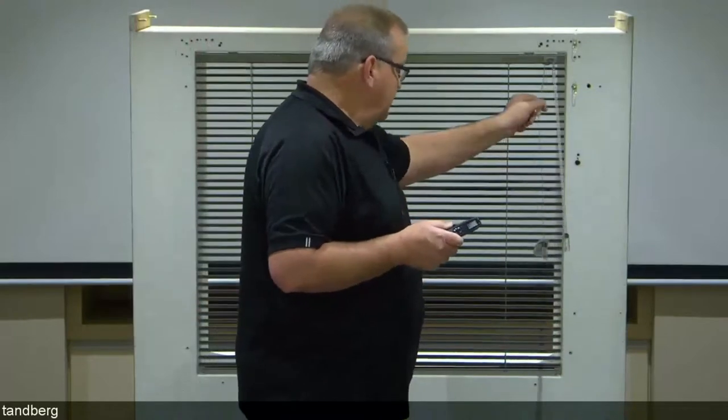But in the slimline, you've also got auto tilt. Now, this is a battery operated auto tilt system, which will allow you to tilt the blades. To raise it, you will still have a lift cord. So to raise an auto tilt, you'll still actually have a lift cord that you would pull to raise it. Reality is, most people with Venetians are really just opening and closing the blades during the day, maybe just lifting the blind up to clean.